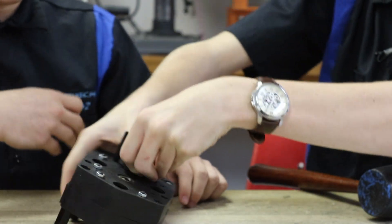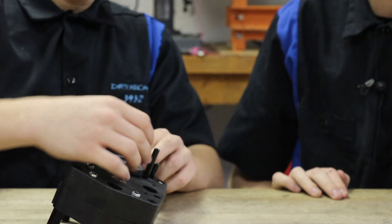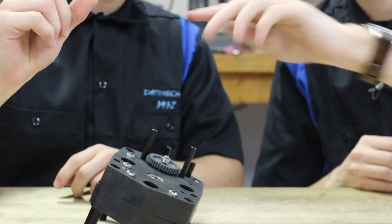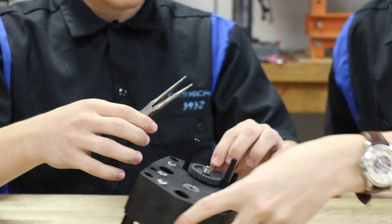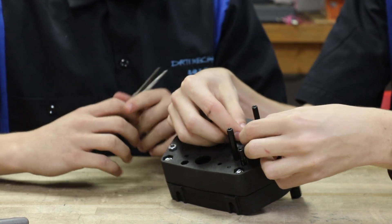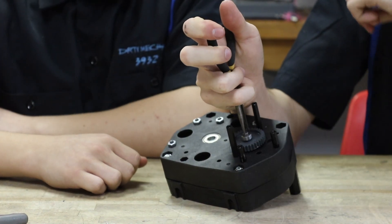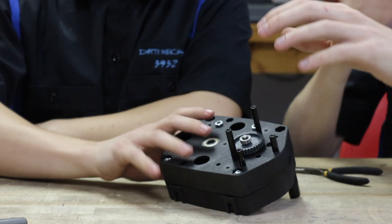You can choose how you want to get that on there — that's how we do it. Next we're going to put a bearing onto that little shaft, and then we're going to put a tiny little C-clip on there. To put that on, we recommend you use a pair of needle nose pliers. You're going to take your C-clip, rest it on there, then squeeze it from both ends. It might take a few tries, but once you get it on there it's going to click into place and you'll be fine.